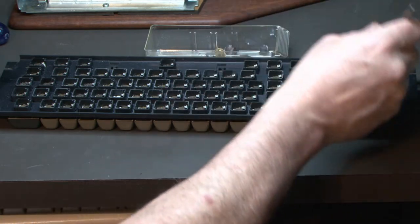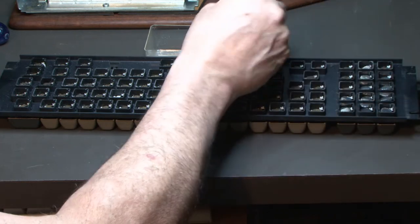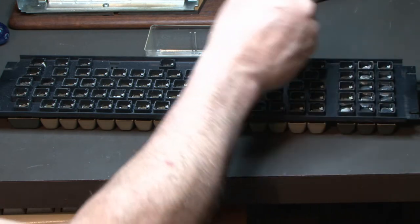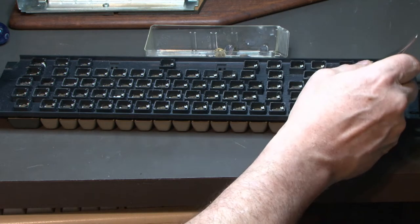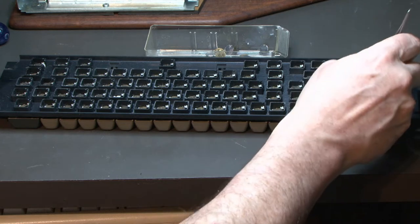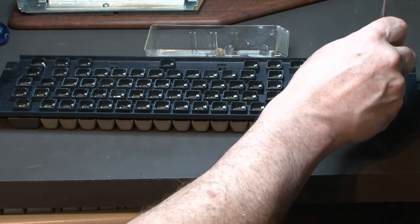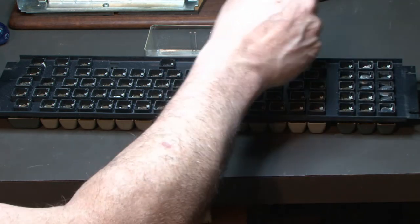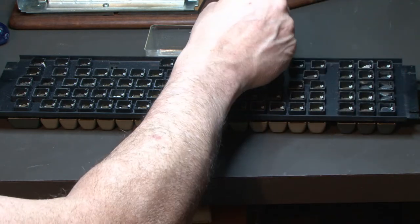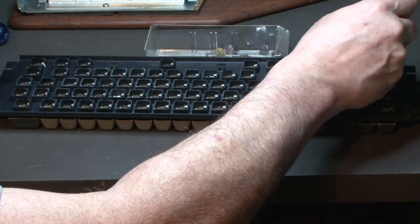So I'm gonna build up another one of those boards for this, I think, and that way I can put it in. I found a couple programs to make CP/M floppies and some game discs, and it's a program that you load in and then it will write a floppy. But what I was thinking of doing is putting it in ROM, so it's just always available. So if I need to make a disc, you fire that up, then you load the disc image through the serial port, and then it burns it to the floppy. So I'm going to build up that homebrew board.